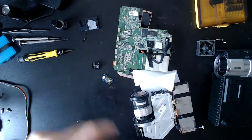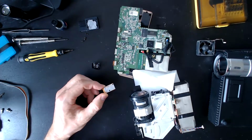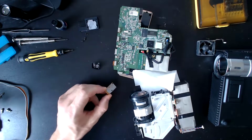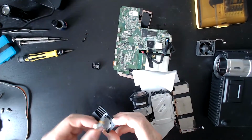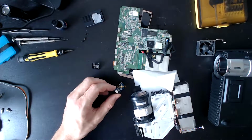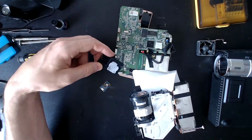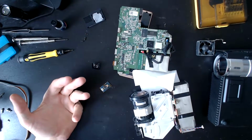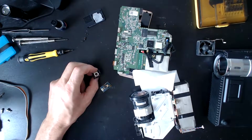So one of the things that I observed when I was disassembling the whole thing was that the thermal paste, I was going to call it CPU paste, which isn't necessarily the right term at this moment. The thermal paste, when I took this out, it just came straight off without any arguments whatsoever. So, yeah, my suspicion is what's happened is the thermal paste has failed, and that has meant that it was not able to cool the LED enough. LED couldn't get rid of its heat, and then probably at that point is when it started to cause the lens to fail.